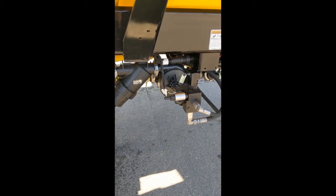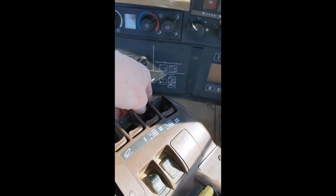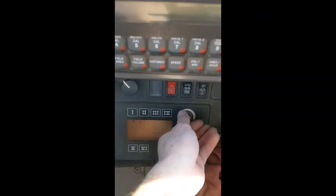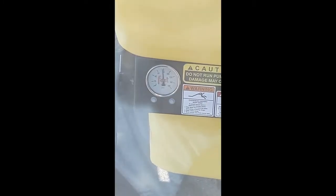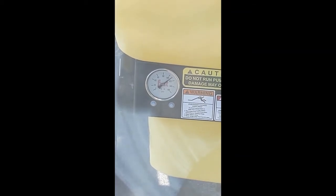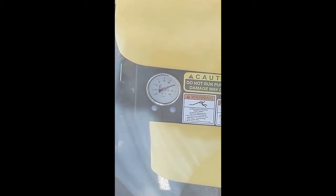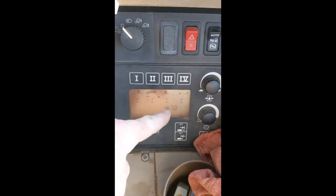The electronic controls will no longer be controlling the pump — this is just for testing and setting up the flows. Come into the tractor and engage your SCV for the pump. Start out with your hydraulic flow very low and slowly begin to increase it, watching the needle rise on the pump. 120 PSI is the max PSI for the ACE 205 pump. When the needle hits there, or when the needle quits moving, stop increasing your flow. This tractor is at 7.